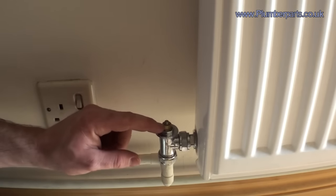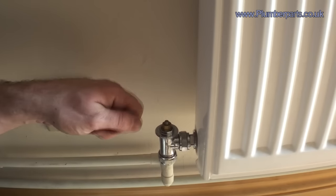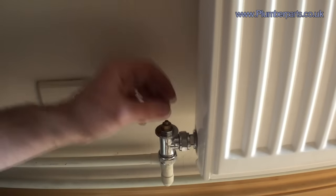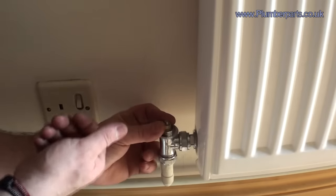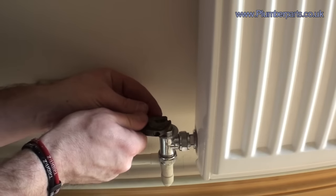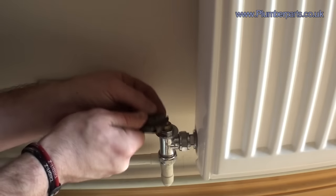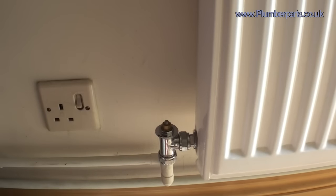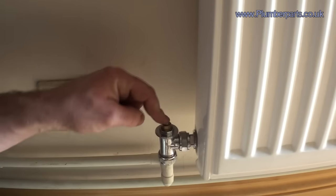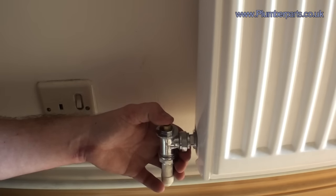Now this particular model won't have that problem, but if you've got a traditional pin-type TRV and you hit it with a hammer, often the pin will just fly out and you'll have a lovely fountain of water come out. The best way to deal with the pin types is to get a very small set of long-nose pliers, grip the pin itself, just wiggle it upwards, pull it up, and that will get it working. Sometimes once you've got it free, you can push the pin back down and it will stay stuck down — at that point you're probably going to be looking at getting a new TRV for that radiator.